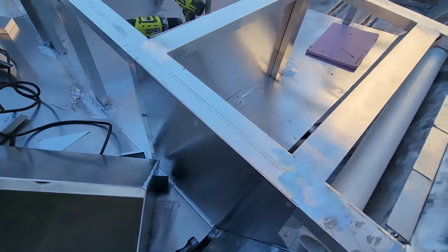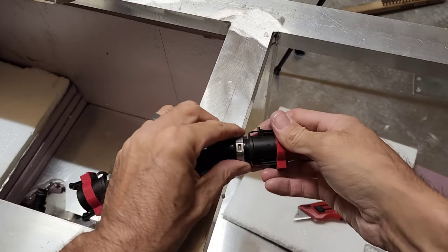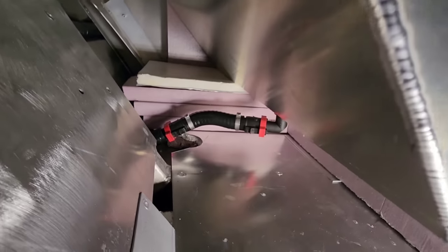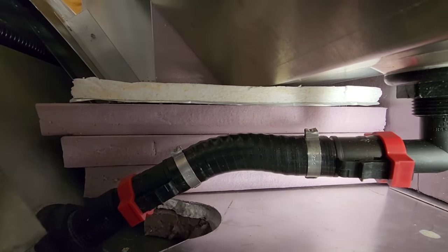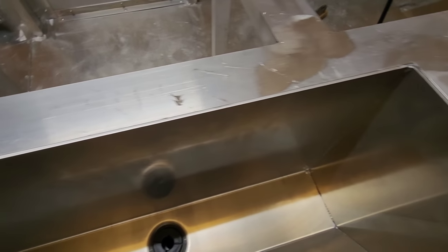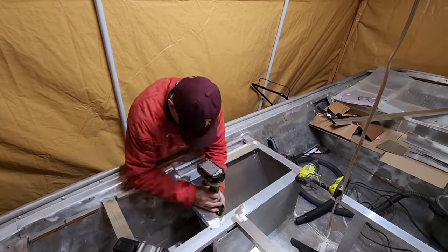We turned our attention to the custom cooler in the front deck. Here, we would also utilize Flowrite plumbing parts for the cooler drain. The cooler bottom had a recessed stamp for the drain fitting. It would drain melted ice downhill and out the side of the boat through a through-hole fitting and prevent water from coming back in with a drain plug inside the cooler. And this cooler fit incredibly tight. I don't think I could have made the framework any tighter and still get the cooler into place. From there, the cooler was riveted in place permanently.